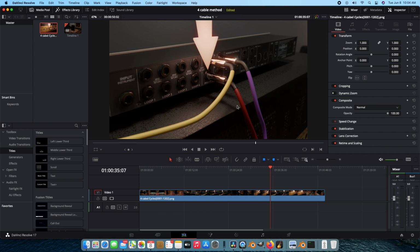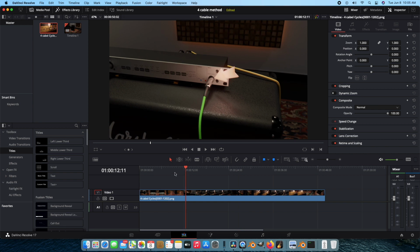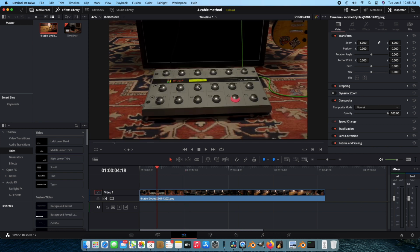So now you have returning here just your preamp sound, and it's not a loud sound. If you hooked headphones up to it or put that signal right into a workstation, it would sound like a buzzsaw, like a distortion pedal with headphones. Just terrible, relatively terrible. So now this unit converts that back into digital and runs it through all the remaining effects. You have modulation, pitch, delay, and reverb.